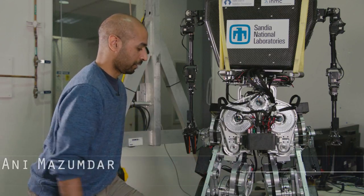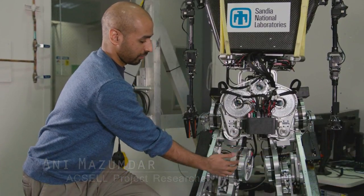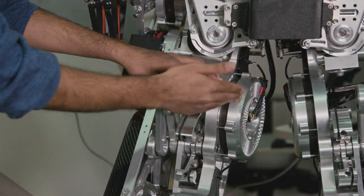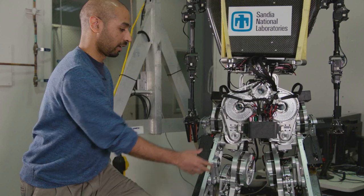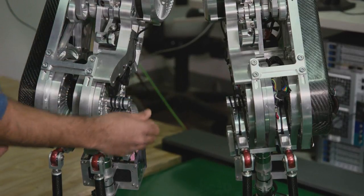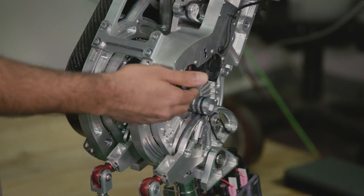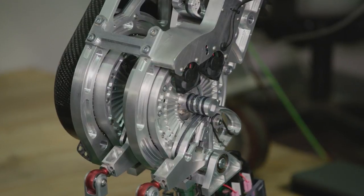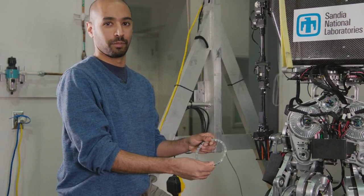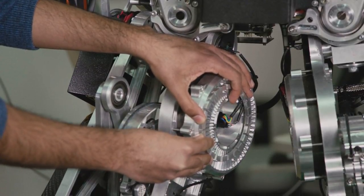In order to maximize the efficiency and performance of our motors, we utilized an open stator housing where you can see that the stator is exposed to the air. This allows us to cool the motors very efficiently, and we can also add fans to provide forced air cooling over the motor stator, which enhances heat transfer significantly. At the ankle motors, we've used forced air cooling in the form of mini-fans to blow air over our motor housings, improving torque performance. We also improved heat transfer by placing a flexible aluminum ring on top of the motor stators, enhancing the heat transfer path between the coils and the lid of the motors.